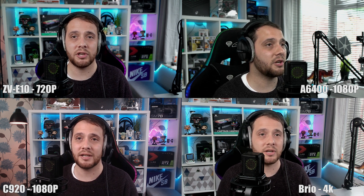I want to do some microphone tests. I haven't been able to get the A6400 working for audio — I think I was running into USB bandwidth issues — so I'll test the other three. Right now this is just a quick audio test of the Sony ZV-E10's built-in microphone array, coming straight through into the computer. This is what you could expect if you weren't using an external microphone in a large room. Next up is an audio test of the Logitech C920 — I found this microphone to be the most sensitive of all of them. I really had to turn the gain down in Windows as it was picking up hums, buzzes, and general house noises. It'll be fine if you're using noise suppression in web conferencing, but I'd recommend using a noise gate with it.